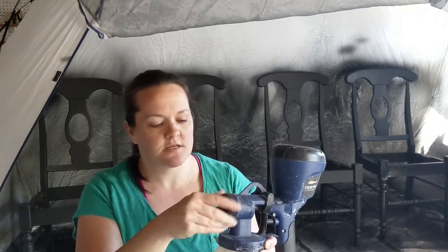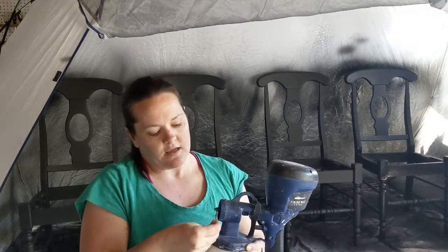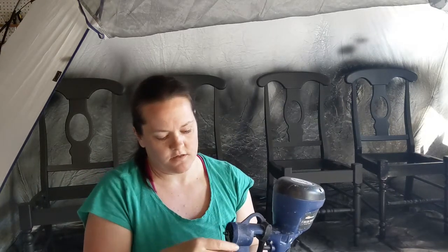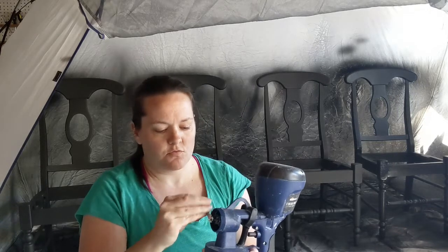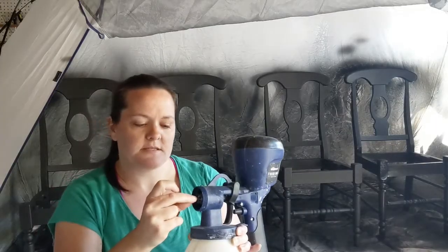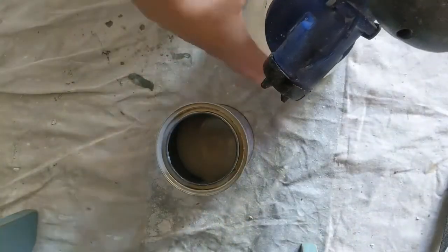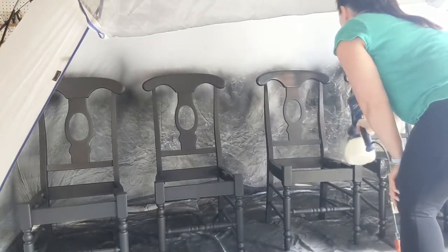You're going to want to change out the tip on your paint sprayer for the sealer. It's really easy — you just unscrew the nozzle, and you'll see the green tip. Use the little wrench that comes with your paint sprayer to screw it off. Then for doing your sealer, a part comes off and there's another tinier little tip that the wrench will also remove. Put the blue pieces into place, then add your sealer to the paint sprayer and spray it onto your chairs the same way you did the paint. You'll need to add at least two coats of topcoat to make sure the finish is really protected, and then be extra careful handling your furniture for the first few weeks.